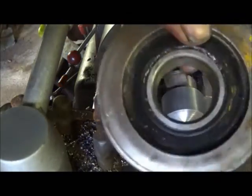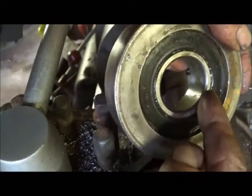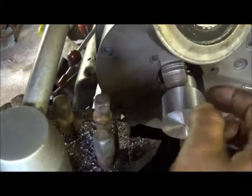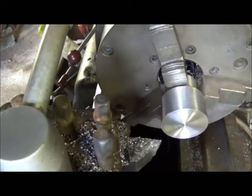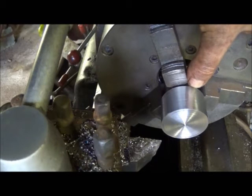Alright folks, as you can see on one of these bearings, this is inset a little ways. My most important thing on these pins, besides the OD and making sure I've got enough radius, is to make sure that this is the right thickness here. And it's actually 350 thousandths on the others. That's what it measured out. So we're going to make sure that the center distance for our lip there is 350.